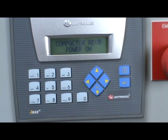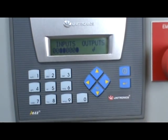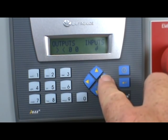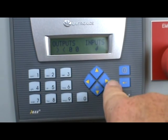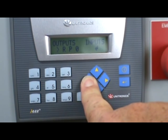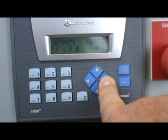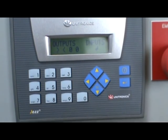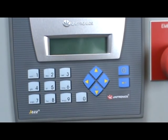To manually move the RAM, you must go to manual mode by pressing 0 and 7 briefly, followed by ENTER. Then you can use the left and right arrows. The right arrow extends the RAM out and moves it forward. The left arrow retracts the RAM back to the home position. This is how you put it into manual mode for running and testing travel. The easiest way to clear back to the main screen is to hit the e-stop, kill the power, and bring it back on to start back up.